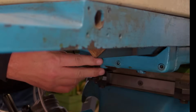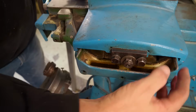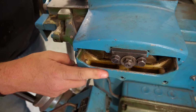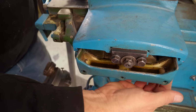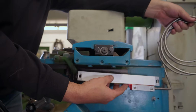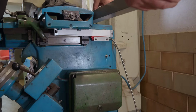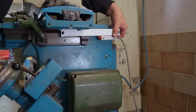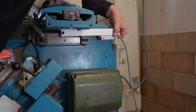If you look at these 3 bolts here, this on the end of the saddle is just a bolt-on casting which catches the oil. And so in discussion with Luke, it seems easiest to unbolt that, make up an intermediate steel plate which gets sandwiched in between here and the saddle, and use that both as a carrier plate to mount to my slide, and at the same time I could extend that with a bracket to pick up my gutter. While it wouldn't kill me to put a couple more holes in these heavy castings, if I can pick up existing holes, I think I will.